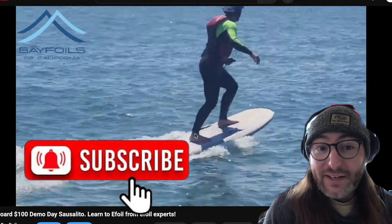Now that we use epoxy, it allowed manufacturers to start experimenting with different materials between the fiberglass layers that add more strength without as much weight. You can see in the picture behind me a traditional surfboard glassing still done today — just layers of fiberglass and a foam core, maybe with a wood stringer. Where we don't need extra rigidity, this is totally fine. But with disciplines like foiling or stand-up paddleboard, a simple fiberglass layup with epoxy is too weak to mount a boom or a foil plate onto.